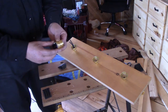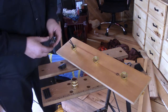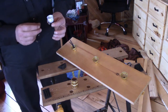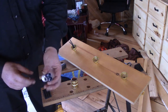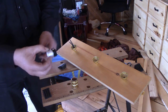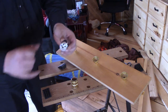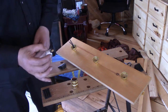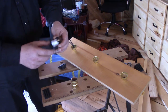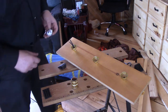And then the base, the other end of the socket, the internal part slides out. And there's two screws on here. One connector is for the socket part, and the other is for the tab down in the bottom. The socket part would be your white wire when you hook it into the power. That's your neutral line, with the center tab in the bottom being the hot.